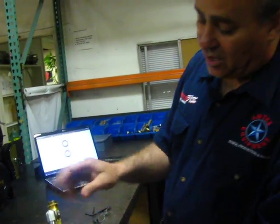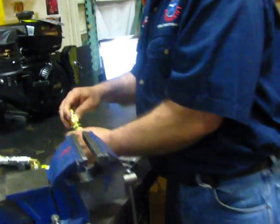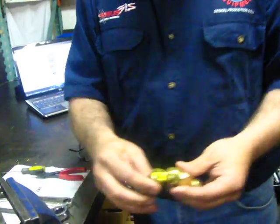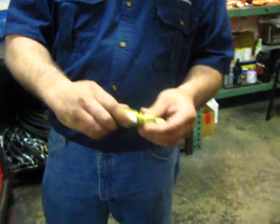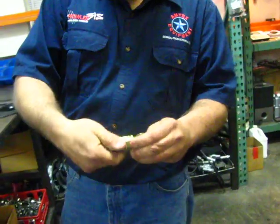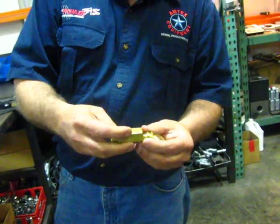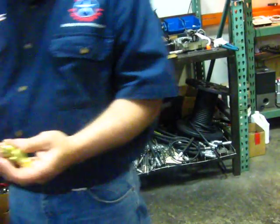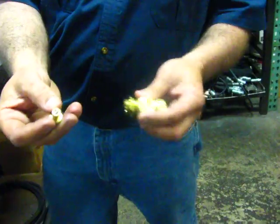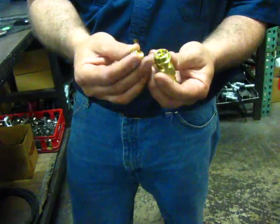Now, let's say we have already removed all the fittings off and we end up with this — this is the part we're going to be working on. This valve consists of several parts, starting with the cap, which helps you pressurize the valve higher by turning it clockwise, and counterclockwise drops the pressure. Remove the cap, which houses the spring. There is a thrust plate that comes out with a ball bearing on one end. If you ever put it back in, the ball goes in first — not the other way. A lot of customers make the mistake of putting it in backwards and then they get no pressure.